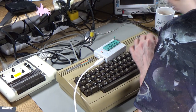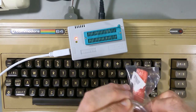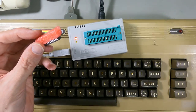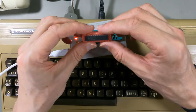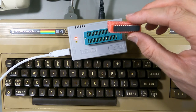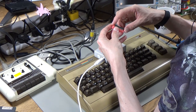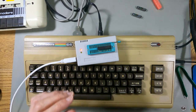These are some I just got from a seller on eBay which sent them in these little ESD foam trays, but then the plastic bag doesn't look very ESD safe - so maybe that was a complete fail. It was wrapped in a giant plastic bubble wrap as well. These are GAL 20V8Bs, which is what it recommends to use on the actual project. I don't know if the A is any different, but clearly there's something odd going on there. Let's stick one of these in and program it.